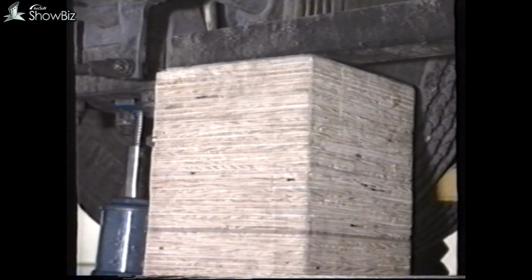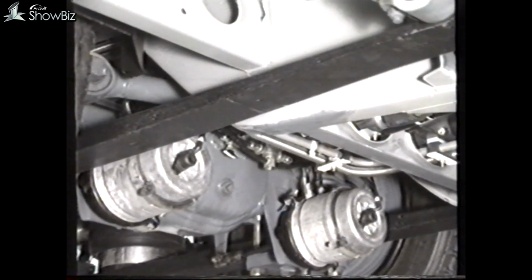If metal stands are used, make provision to avoid scratching the taper leaf spring, and be aware that you should not at any time jack or block under the taper leaf spring at the front of the axle where the leaf is much thinner.